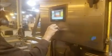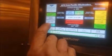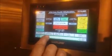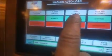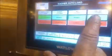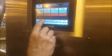Very good. Okay, I'm going to break in here now and we're going to show the screens on the test view. First thing you want to do in the morning is take this to manual mode. You come down where it says washer manual screen, and you go to your washer load-in, push that, and it takes you into the washer load-in only. You're gonna test to make sure your pushers are working well. You're gonna bring the load tray up, and bring the swing arm in, looking for anything wrong. Swing arm one more time, I missed that one. Bring the swing arm in so you can see it, and make sure everything's working properly before you start the machine. They'll go through training on the HMI screen down there. All right, I'm gonna pause again, step back out, and we'll do the transition.